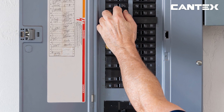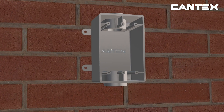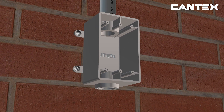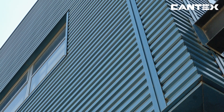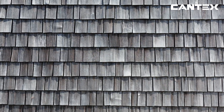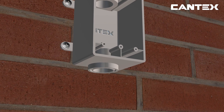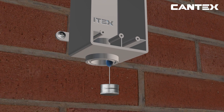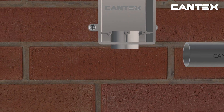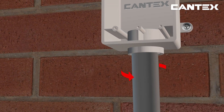Always turn off all power prior to any electrical installation. To install single-gang and two-gang FSC boxes on brick or cinder block, begin by screwing the box onto the wall with the screws provided with an electrical screwdriver. For structures with siding, shingles, or uneven facing, other steps may be necessary. Follow the manufacturer's guidelines for any alterations to shingle, siding, or other facing products. Next, apply Cantex PVC cement to the inside of hubs with the dauber. Then apply the cement to the outside of the PVC pipe you are inserting into the hub. Insert the PVC pipe with a half-turn for proper cement dispersion.